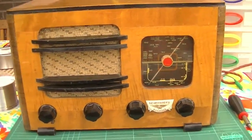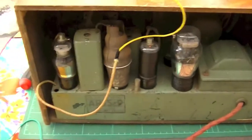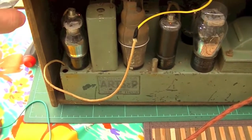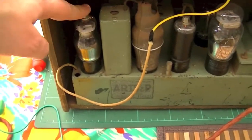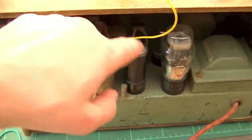I'm only guessing, and I'll just get up and show you. It uses octal valves, but the top caps — instead of being the regular plate connection as we're all familiar with — it's actually the grid connection, which means I can safely touch it without worrying about getting B-plus on me.